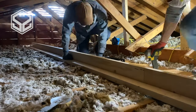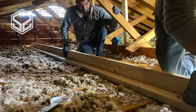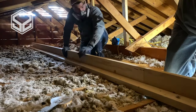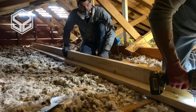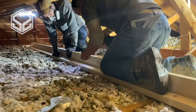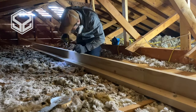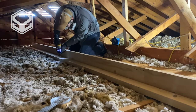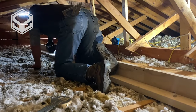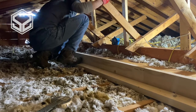We checked, they have hangers on them, they're attached really well, so we're not worried about the pressure going down on this. 2 feet is not far enough to cause those boards to warp at all. Now, once the strong back is in place, we're gonna come down through here and put 3-inch long screws into the rafters to pull them up into place. And you can see a couple of them were a little low, so that's gonna be evening everything up and distributing the weight across all of these. Next, we're gonna put 2 nails from the nail gun in each of these to make sure everything holds really well once they're all in place.